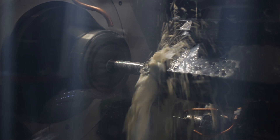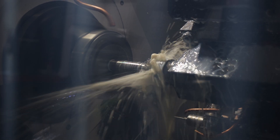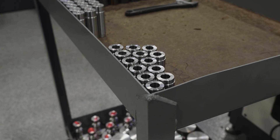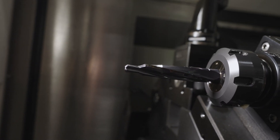We were also thinking about dies in the future, and we've got a reamer running right now. We're able to preset the length out of them, and when we get a fresh reamer we can measure all the dimensions of it and compare it over time so we know when it's time to replace it. That was a really big point of concern for us to take advantage of.